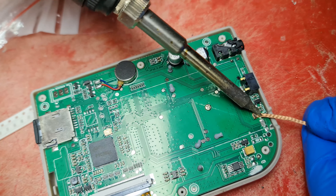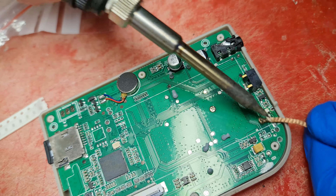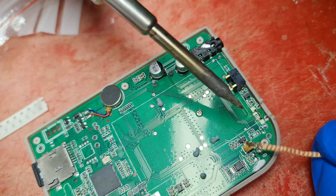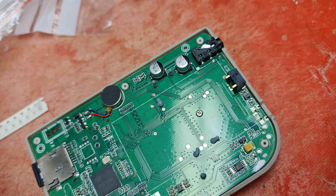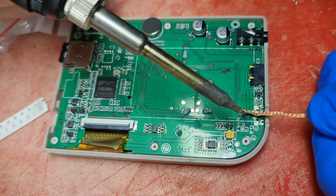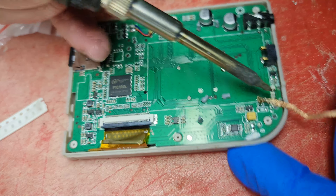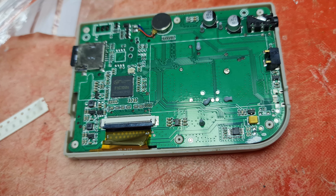It's very, very difficult to do on camera. The solder they've got in here is horrible — it's not really flowing as such, but that seems to have cleaned the pads up a bit. I'm going to drop a bit of flux in there, then have another go. All right, that seems to have got a lot of it off.